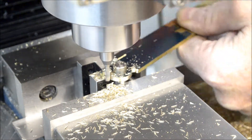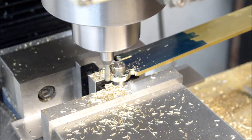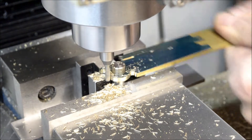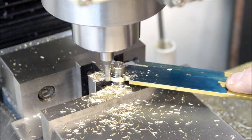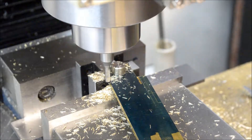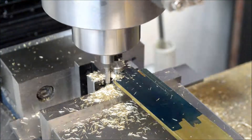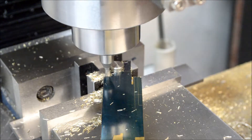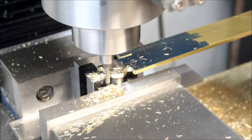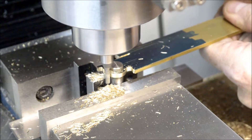This technique seems to work real well when you want to trim a radius off. The only thing is sometimes the milling bit or end mill wants to pull the part up off the pivot. So I'm thinking next time I'll cross drill the pivot pin and put a little hairpin clip, or even a piece of wire stock, just to keep it from being pulled up. But overall it seems to work real well.